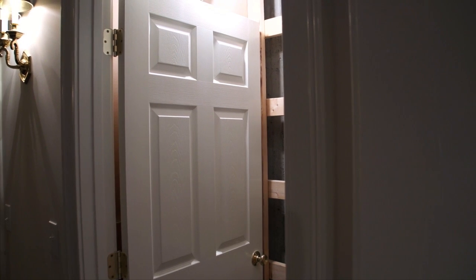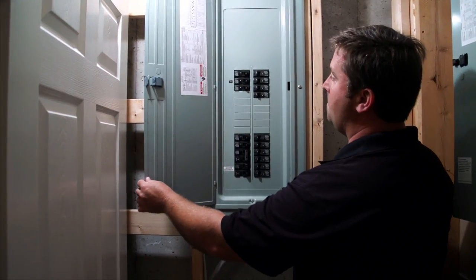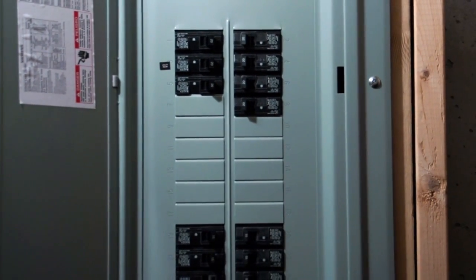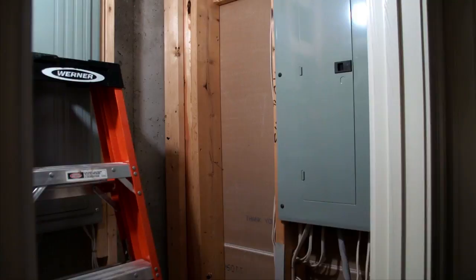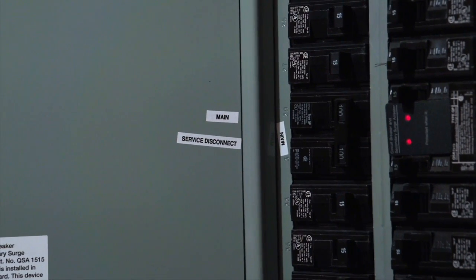First, you should know that the station can draw up to 30 amps at 240 volts AC, 60 hertz. To begin, verify your panel has an open position for a 2-pole breaker and that the 30-amp draw from the VersaCharge will not exceed the loading for the main breaker of the structure.